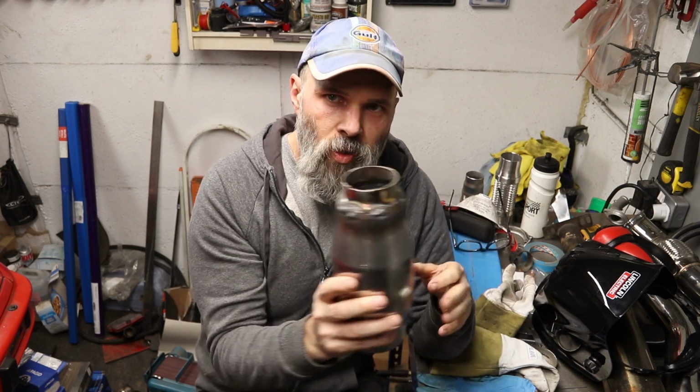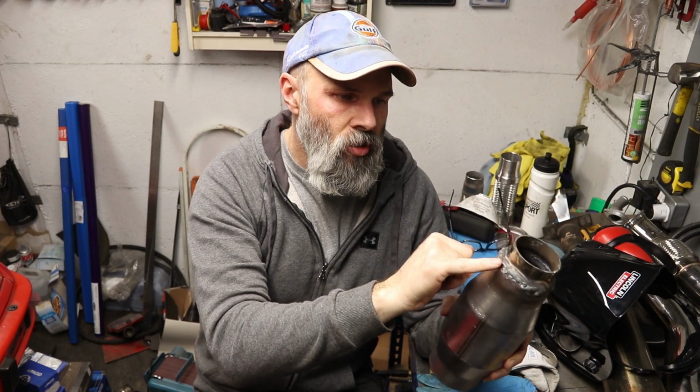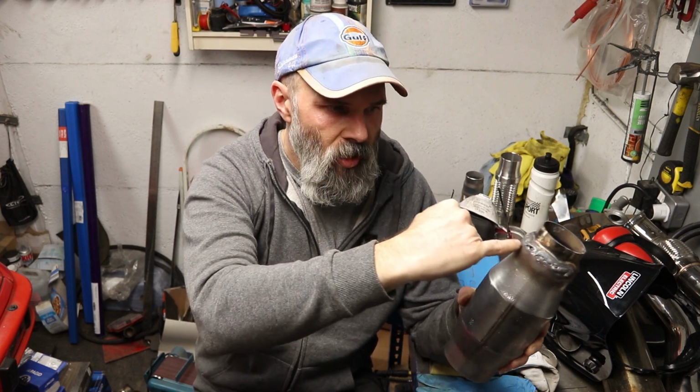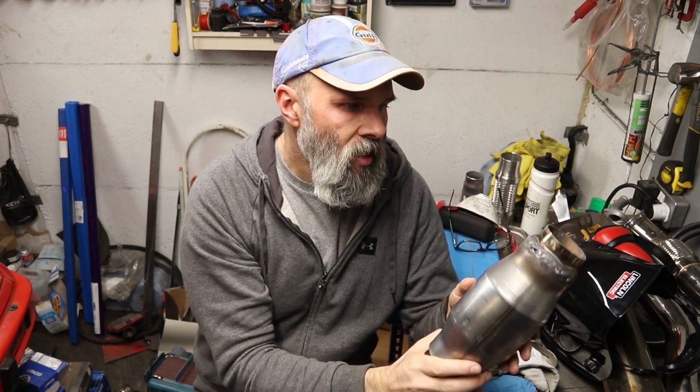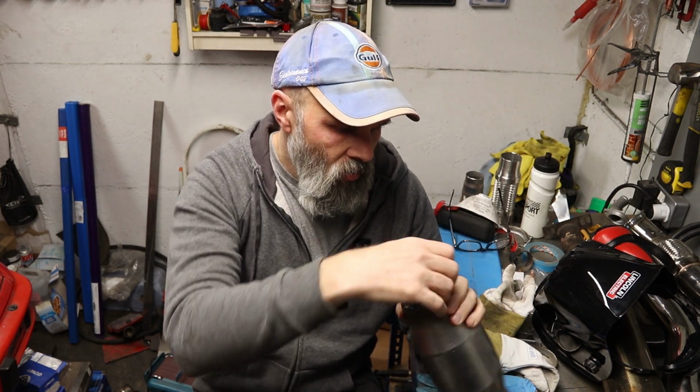I've been really careful with the grinding. I've had problems before, ironically, when I've been grinding stuff back, and what's the problem then? Oh yes, I've gone through the welds trying to tidy them up, but then I've gone too deep into the underlying material, and that's just made it really thin, and then you just end up going back and back and back. So sometimes I will settle for things just looking a bit scrappier, just to get everything done and dusted properly.